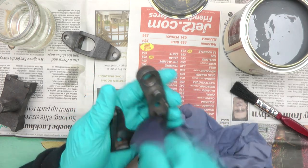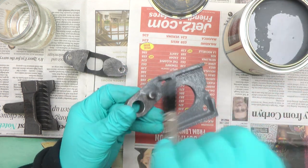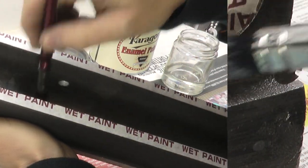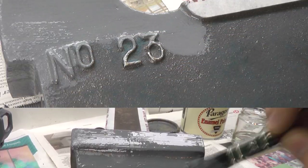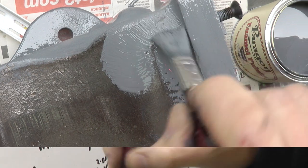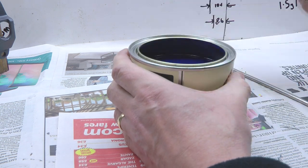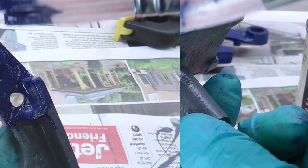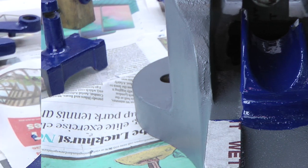After wiping everything over with PT8 thinners, I undercoated with zinc phosphate grey primer. I started with the smaller bits first to get a feel for how the paint went on. It's quite thick and high build, so it filled the pores and scratches in the castings. I'm a ham-fisted painter at best, but it resisted most of my attempts to make it run and sag. Once dried, I top coated with BS381C 110 roundel blue gloss. If I hadn't been in such a rush to check out from the online shop I'd have probably gone with a satin finish, but I'm sure the shine will wear off a bit with time. The enamel was really forgiving and went on surprisingly well.